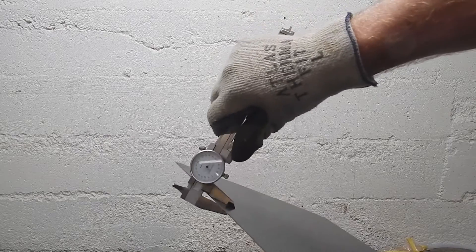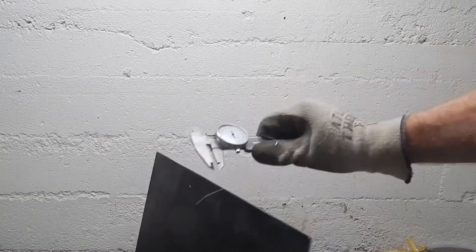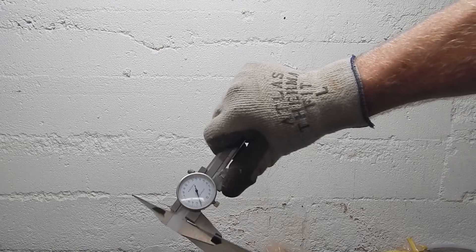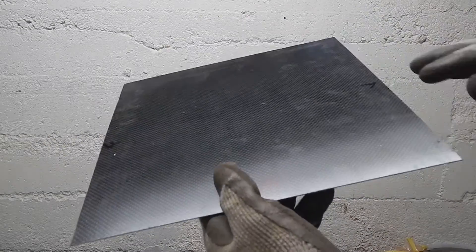Checking the thickness, it is pretty much exactly the same thickness on the inlet resin side as on the vacuum side. Often you'll have a part where, because of problems with the infusion, it will be thicker with excess resin on the inlet side and resin-starved on the vacuum side. But here this worked out really nicely — it's about ideal.